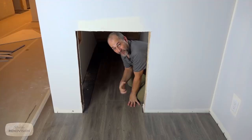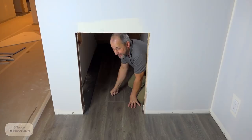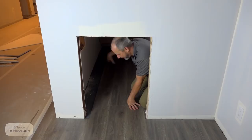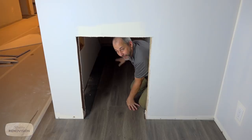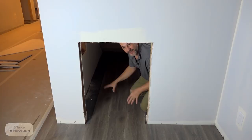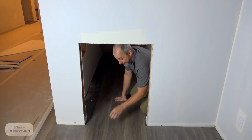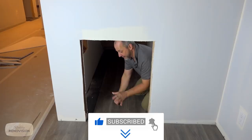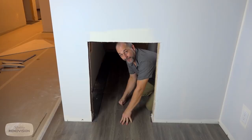You'll notice that we made the intentional decision not to put a transition in this door area. Traditionally speaking, in a space this big you want to transition every room just to help minimize your risk of buckling of the floor during expansion and contraction seasons. But this area here is right in the middle of the house — shouldn't have a contraction issue. We didn't take it all the way to the end of the stairs; it's about an inch and a half shy of the step. Since boards usually grow in their length, not their width, there's actually a lot of room in here for this floor to make adjustments with temperature and moisture content. Most transitions made for laminate flooring are really just paper-wrapped MDF and aren't likely to stand up to the wear and tear that kids with shoes running in and out will bring. By doing it this way, we have just the finished floor, which is a really high quality laminate with a nice 30-to-40 year finish on it — it should outlast the kids.